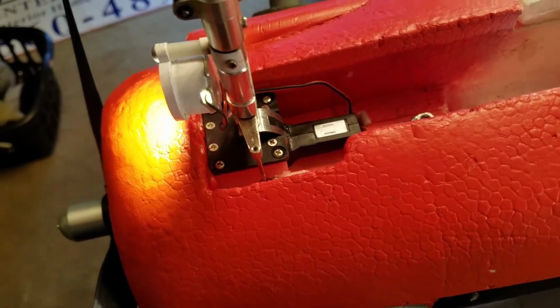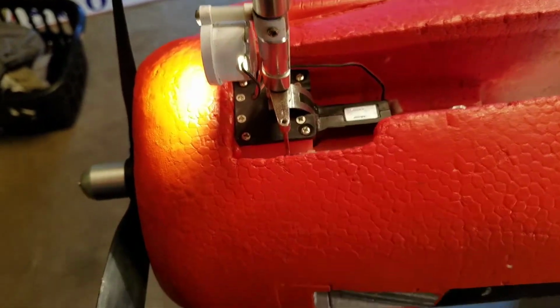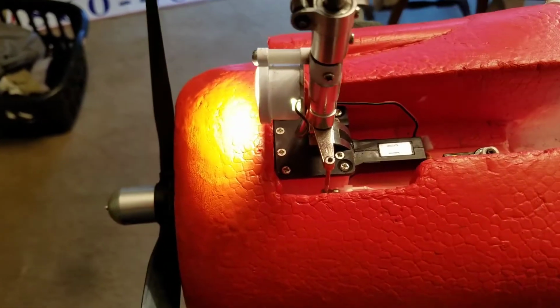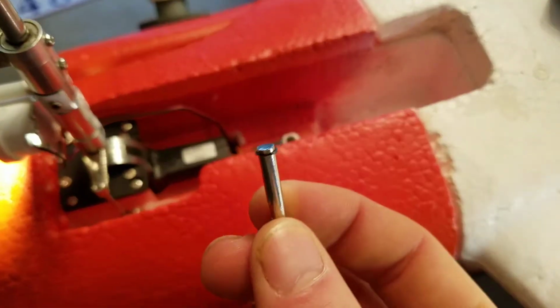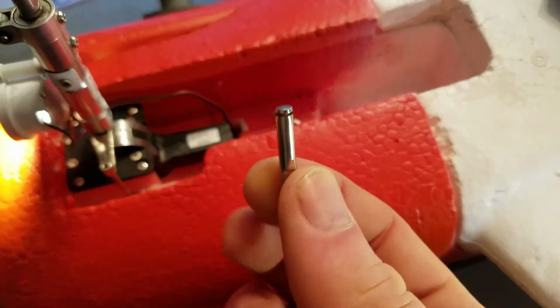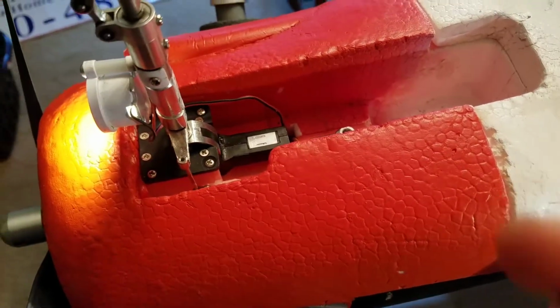So after I put that in, first I had to drill out the trunnion, of course, and that's easy. You guys can do that. Drill out the trunnion. You might have to notch a little bit off parts of it to fit the little C-clamp down in there. I'll get to these in a minute.